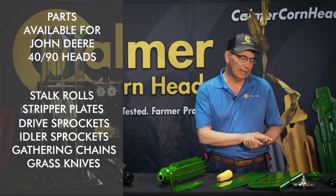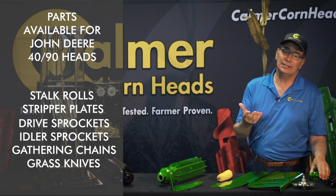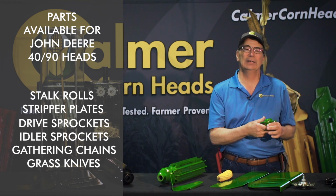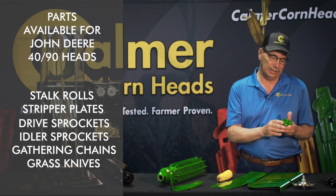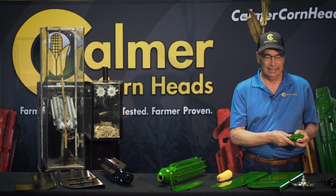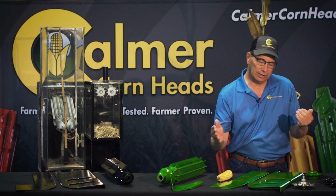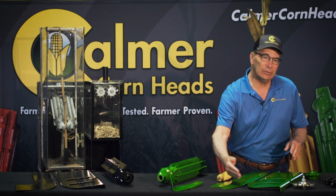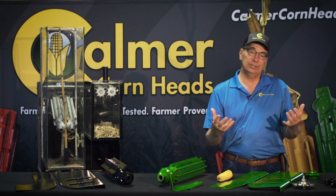Also along to enhance this kit just a little bit more is a different set of sprockets for the 40 and the 90 series. In my humble opinion, when I ran and tested that corn head, we felt that the gathering chain speed was too fast. And the speed ratio of the gearbox made it so that on a dry afternoon, the gathering chain would come around and work an awful lot like a silage chopper, and it would just cut the top of the stalk off and shove it on back and into the combine.